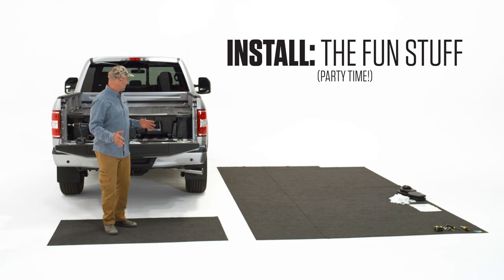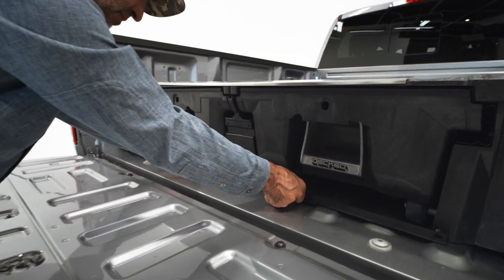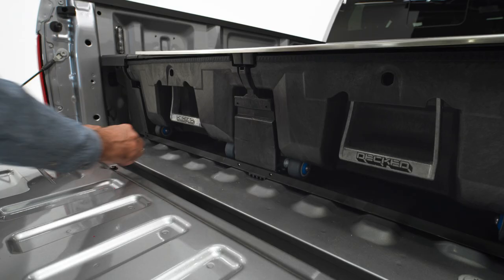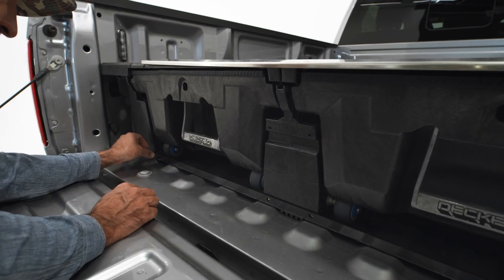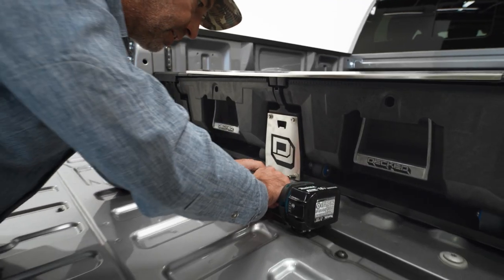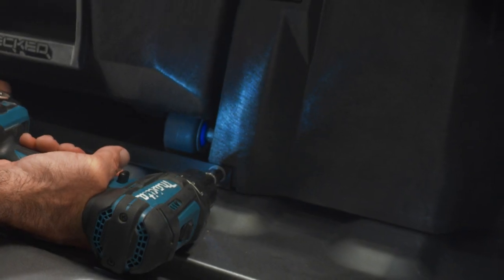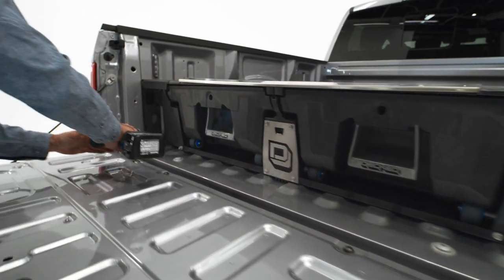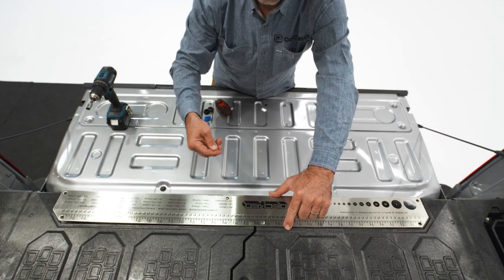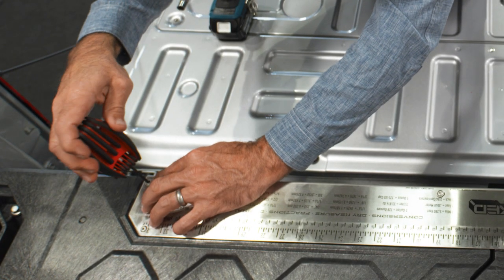This step we call the fun stuff — we're going to put on the torsion brace, the bottle opener, and the ruler. We're using the brass inserts with a screw, so turn the clutch down on your drill so it's not too tight, slow speed. Gently tighten down the middle ones first, and then once the middle is tightened down, move out to the outside and tighten down those last ones. For the ruler install, get each of the ruler screws just started with a little finger pressure, then go back with your hex key and snug them all down.